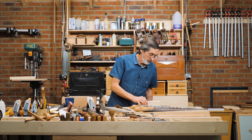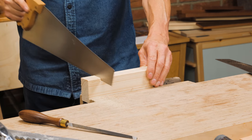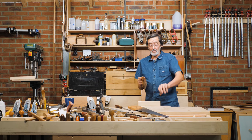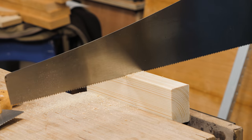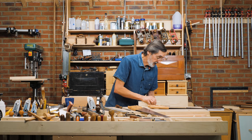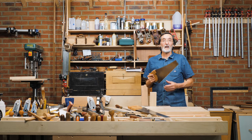If I take this piece of wood and I cross-cut with this saw, the saw just glides through the wood. If I just use my two fingers, it's still cutting because the weight of the saw is doing the work. If I go with the rip-cut saw across the grain, the teeth are grabbing — can you see what's happening? I can cross-cut with it, but it's really ripping the grain and ripping the surface of the wood. Not comfortable at all. Take it for a rip-cut along the grain and it glides into the wood and rips.